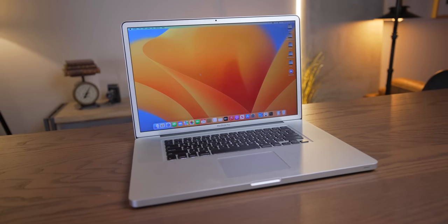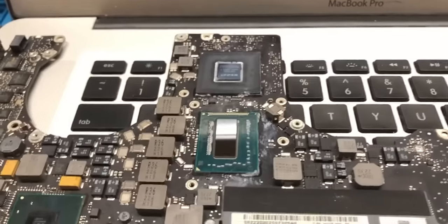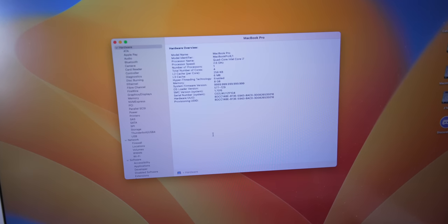My theory was I'd just take the chipsets from a real 2012, re-ball them, solder them on the board, and then use the firmware from the 2012, and it'll just work. Of course, that wasn't the case, because a lot of the PCH I/O is used for completely different things on the 2012, so the firmware is taking that into account. So I custom designed a port for this specific upgraded machine, and after a lot of iterations it took quite a while. I got it working with every piece of hardware fully functional in the system.